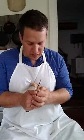And again, tangentially split wood is less forgiving than radial in that in this bandsaw cut running around it, if you go in the wrong direction even a little bit, sometimes it can split deeper into the spoon outline than you intended, and that is less prone to happening with radially oriented, for reasons that I haven't quite articulated yet to myself. Otherwise I'd articulate them to you. So you have to make sure you're going in the right way for the grain.